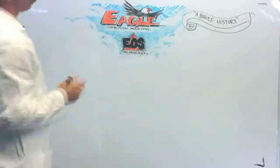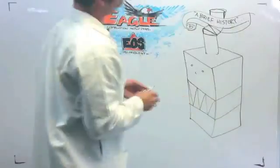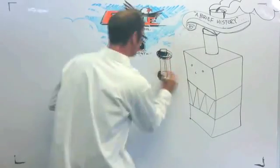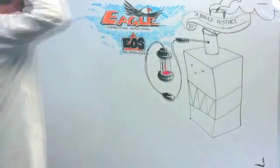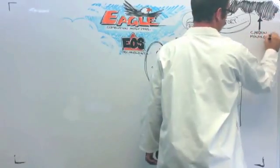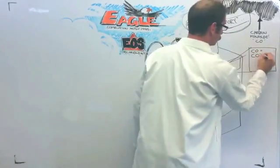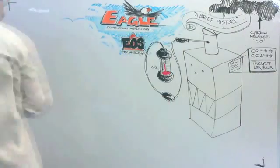First, a brief history. The first combustion analysis was done by measuring carbon dioxide, CO2, using a CO2 indicator, or dumbbell, and measuring the amount of smoke produced, indicating carbon monoxide, or CO. By observing the CO and CO2 levels, a technician could accurately adjust an appliance's fuel ratio, determining the ratio was too rich by measuring CO, or in this case, smoke. Appliance manufacturers would specify, and still do, target levels for CO and CO2.